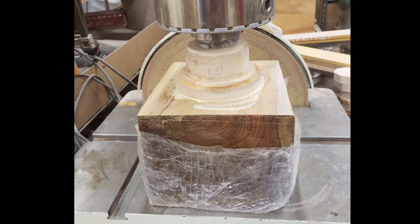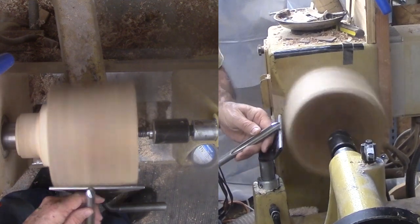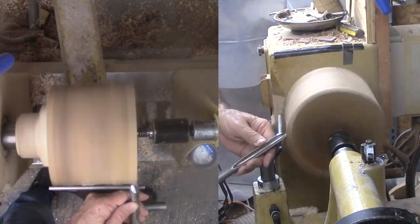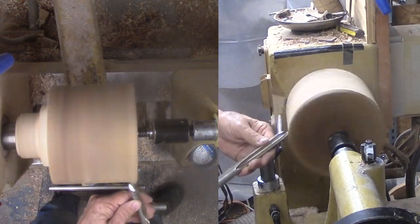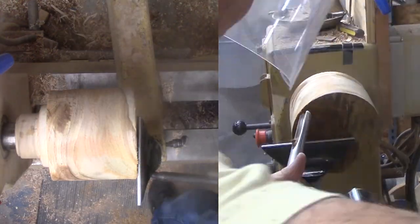When the glue is dry, I also cut the corners. One advantage to this practice is that I can take the project wood off and on the lathe multiple times without worrying about positioning it back exactly in the chuck. In the end, after the waste block is parted off, I face off the waste block to make it ready for the next project. Now the wood is ready to go. The live center provides insurance and vibration dampening. It does not take long with my bowl gouge to trim back the wood. However, I note that the wood is not quite dry.